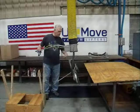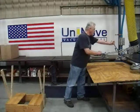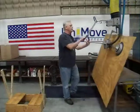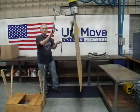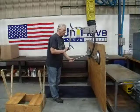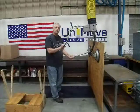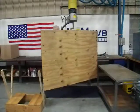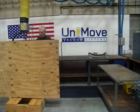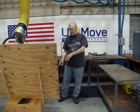This handle will enable them to get across. What we're going to do now is bring this handle up like this. Come down with the Unimove. Lift the sheet. The first piece that you have, you can go right to the cart and put it down on the cart and release. When you do the next one, you're going to have to turn it around, so you've got to come into something like a V-channel. That V-channel will have to have a gap on the bottom of about 2 inches to allow for the lift on your piece.